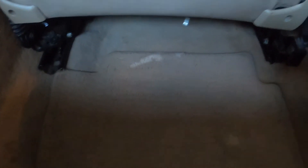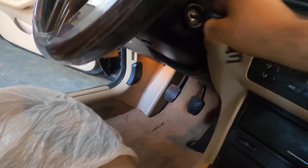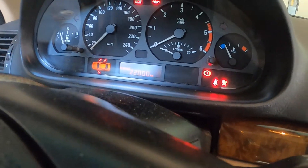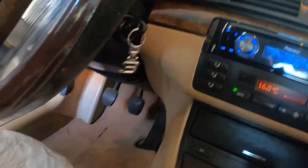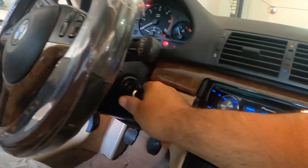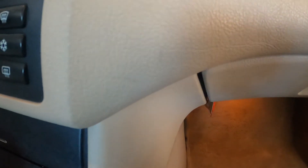We're back in the car. Let's get the plug and connect it — like this. Make sure the ignition has been turned on and then cycle it back again to see if the warning light goes away. Okay, it doesn't go away — I'll need to connect the diagnostics computer to the round OBD port. Let's see how it goes.